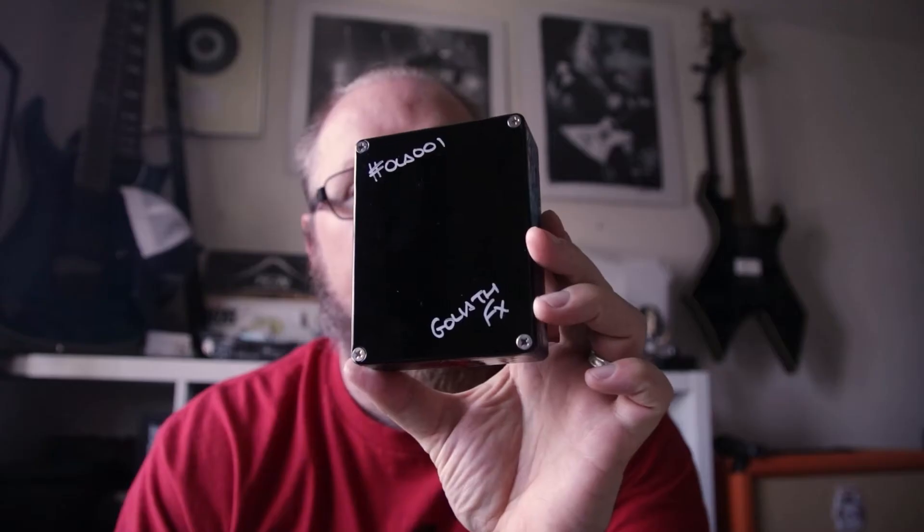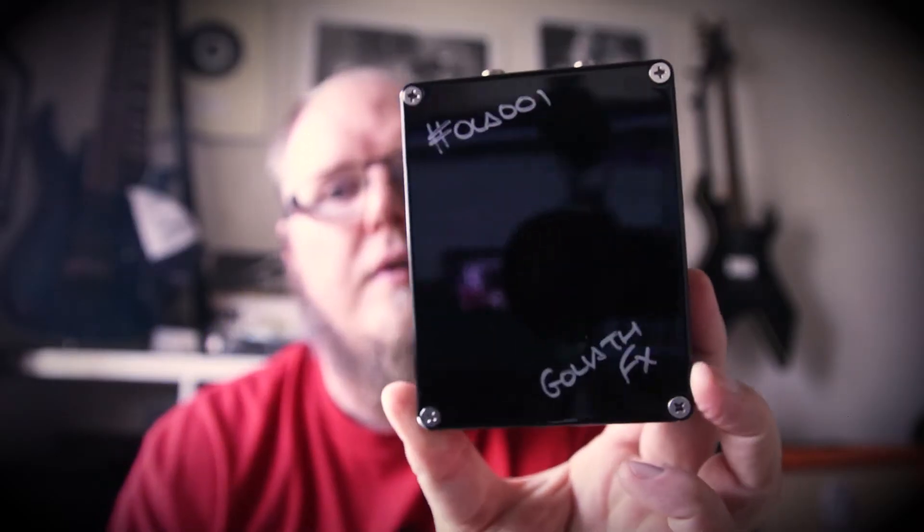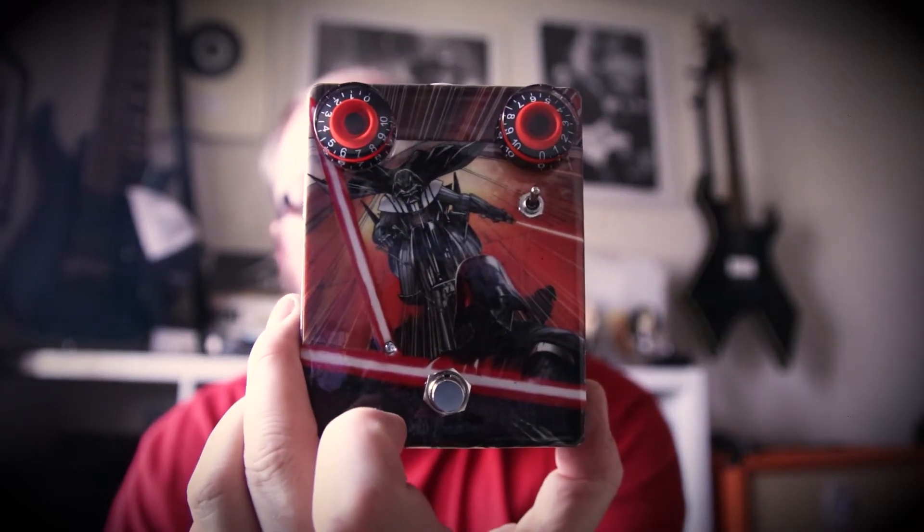This is probably not going to feature it, but I am really happy with how it's come out. It's a simple transistor overdrive circuit. I've put asymmetrical clipping in one position and LED clipping in the other position. The LEDs give it a bit more bassiness, and then the asymmetrical ones are a little bit warmer and a bit more treble-y. That's what I hear — hopefully you will hear that through the little demo as well.